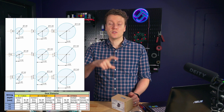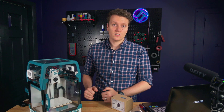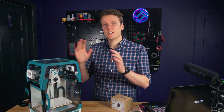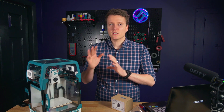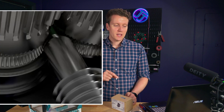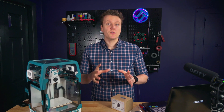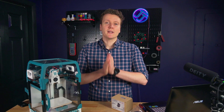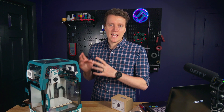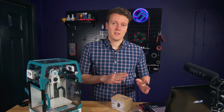They're also using new drive gears that are 12 millimeters in diameter versus the standard 8 millimeters used on a lot of other designs. The LGX is the only other one that uses bigger gears, at 18 millimeters. There's a whole section in the article on why they went with 12 instead of 18, since you're sacrificing weight over performance — 12 millimeters seems like the sweet spot. The V2 also uses a stainless steel filament exit guide with a 0.2 or 0.3 millimeter clearance between the gears, improving performance with flexible filaments and lasting longer with abrasive filaments.